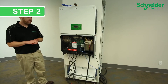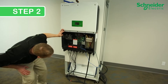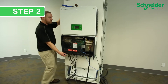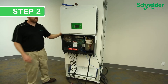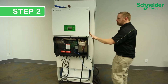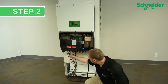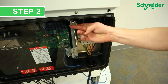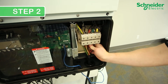Step 2: Perform a visual inspection. Ensure the PV inverter is accessible for operation, maintenance, and service. Confirm that the inverter is stable and secure on the wall or metal framing. Check that ventilation is not impeded in any way. Check and remove any objects such as tools or extra screws in or around the PV inverter. Check that the PV string cable connections and cable glands are attached and sealed securely. Check the AC conductors — both on the input and the output — are tightened properly and secure.